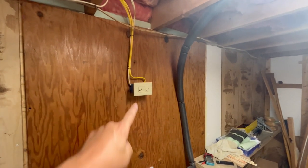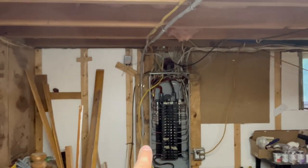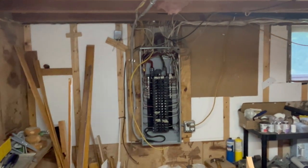Alright, got the receptacle all closed up here and wired up, and I have the wire — you can see it all the way over there, just in the box. So now I got to get that part done. And before I close this up, I did actually use a multimeter and tested it to make sure everything was good between here, the switch over there, and the power panel.